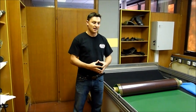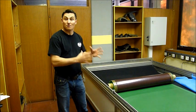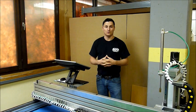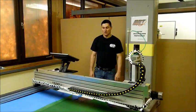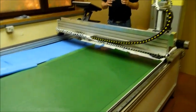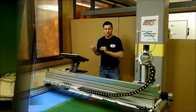The 200 gram carbon is used for the aesthetic part of the carbon piece, and the 430 gram is used in the reinforcement part. Here at the CDT factory we're at the cutting room. This is a very special machine — a fully digital cutter, custom made to CDT spec. This CNC cutting machine is fully supported by a digital touch screen. The material is held in place by vacuum, so when the cutting machine is in operation the carbon does not move. It's all touch screen.